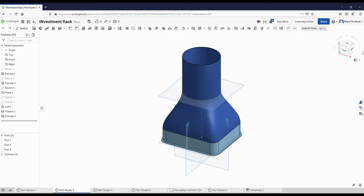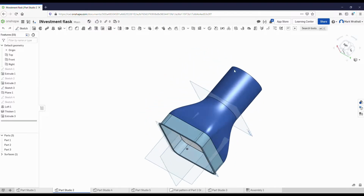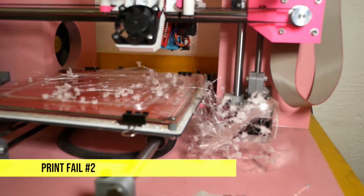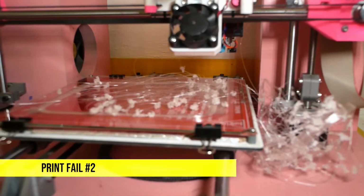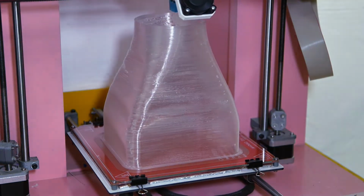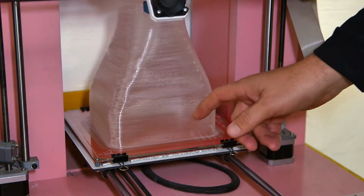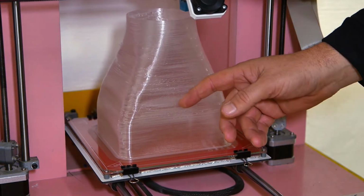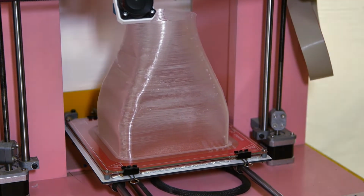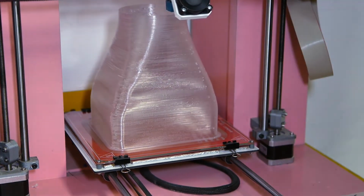So I'm going to need some sort of a flask to hold George while I pour in the investment plaster. Using the settings for kind of just doing a shell, like a vase, wasn't quite as successful as I was hoping. Well, after a couple of false starts, I'm now printing the flask that I'm going to cast. Yeah, only using 2 layers of wall thickness here, so it's not looking very pretty, but nothing that a bit of tape won't fix. Once the plaster hardens, just cut this off anyway.